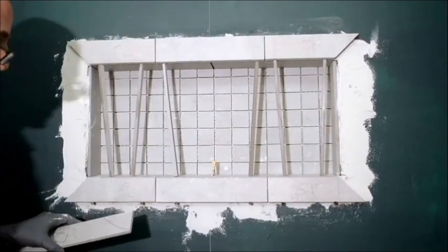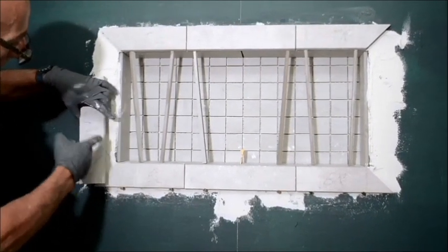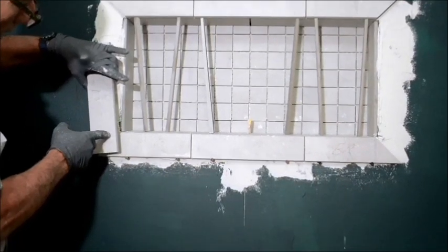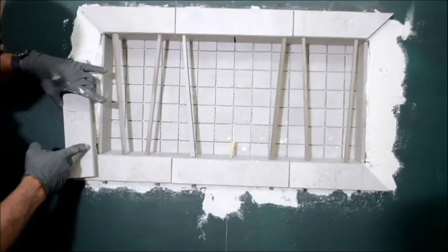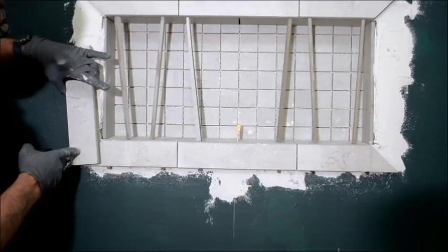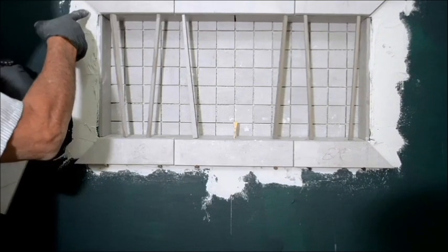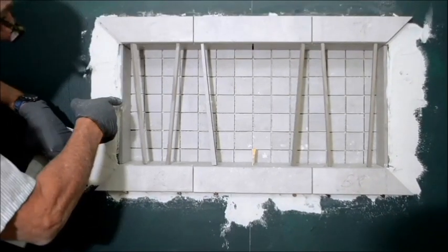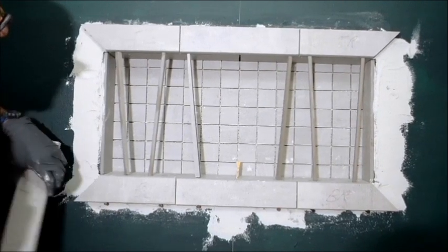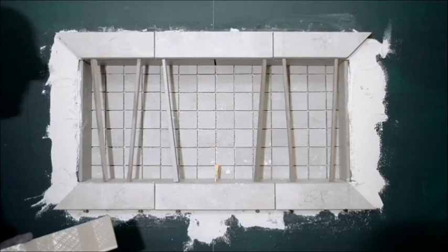So anyway, what I do is, again, I'm going to find my center mark. It's going to be about 6 inches. I'm going to cut off from that point here. This is just a rough line, but I'll put a square on it on my tile saw and make a perfect 45, and then from the edge of that 45, 6 inches up, and the same in reverse here. I'll do a 45, 6 inches down, and then I'll end up with my cut, or my grout line, right in the middle. So that's about all I can tell you about building in a niche.